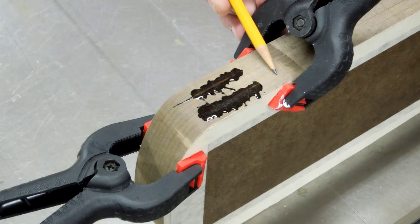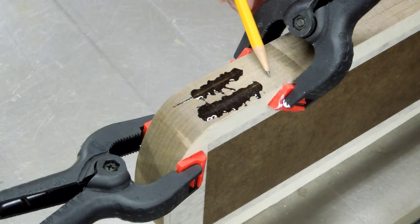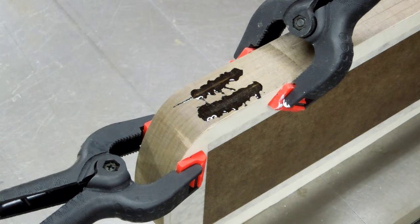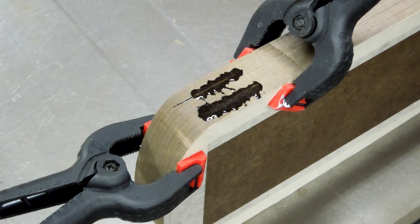The original edge on this 1/8 inch hardboard is rounded, and when I cut these out I picked up that rounded edge right here on the widest part of the blade. So I put some 5-minute epoxy in there to fill in those little gaps. Once that's good and hard I'll sand it flush and it'll be just like the rest of the material. Then when I go to the router table, the bearing on the round-over bit won't be following that distorted edge.